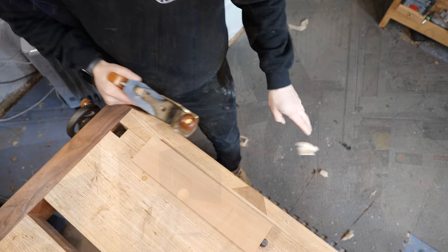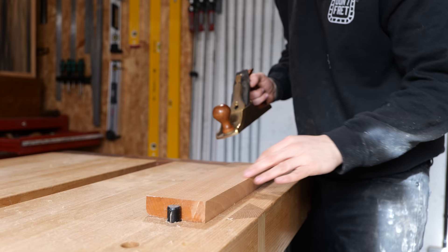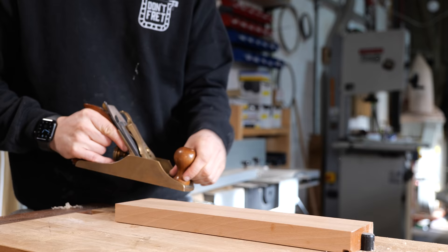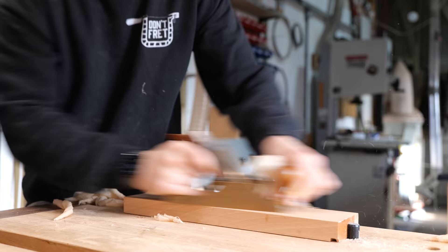The other thing I'm doing here is letting my legs carry me through the cut. My upper body stays locked in position and my legs are doing all the movement required. Of course, this is heavily dependent on the length of timber — if it's five feet long, you're not going to be able to do the entire thing with your legs. Just try to focus on it a little bit more than you already are, because what we're trying to untrain is arm-only movement. Sure, it's quite good for rough material removal, but you're not going to get a lot of accuracy from it.